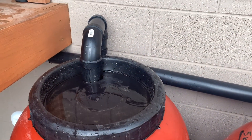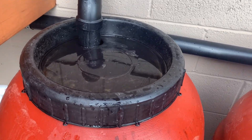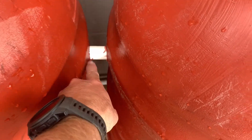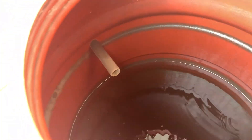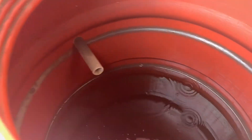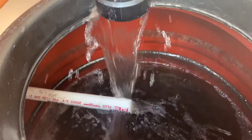So you can see this is the only flow into the rain harvesting system. What we did was we cut some holes with a hole saw and put a three-quarter inch pipe through there. If I unscrew the top you can see — this will overflow once this one gets up to the level of that pipe and overflow into the rain barrel on the right.